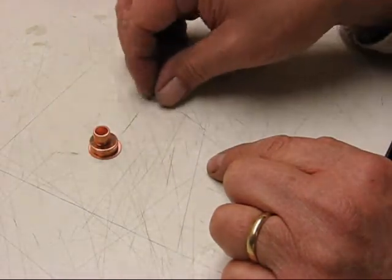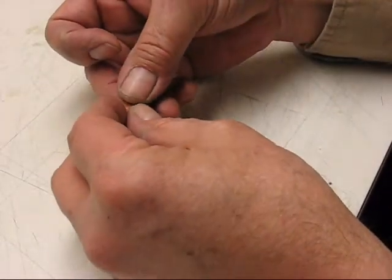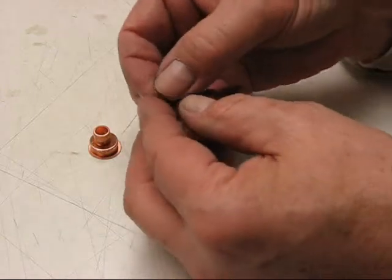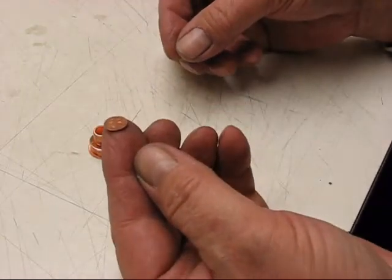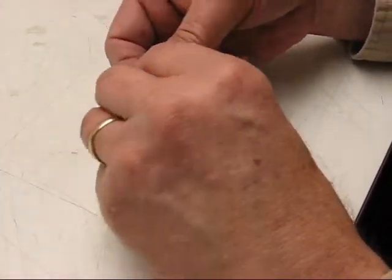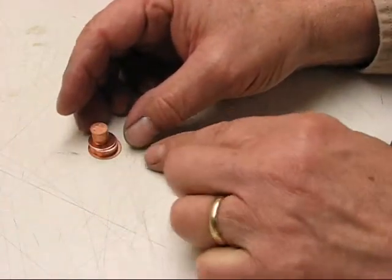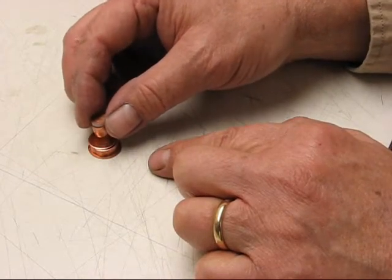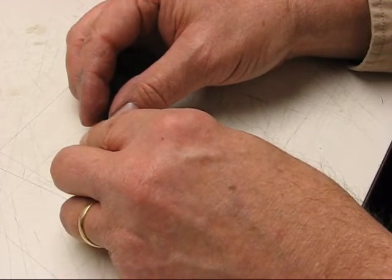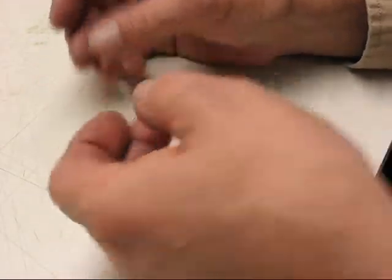On top of that, I still use my plastic washer and I still use a very thin copper positive terminal — I think this is 12 thou thick, maybe 0.010, so it's very thin. Then solder the wire to it, run the wire down to the LED and tighten it all together, pulling the wire tight when you solder it, and it keeps that contact in place. You can even put a little thermal glue on it if you want, which I do just so it's held a little better. The wire, if you tighten it as you solder it onto the LED, pulls everything tight.